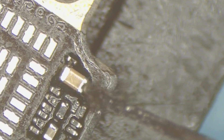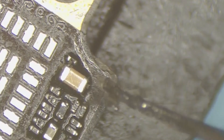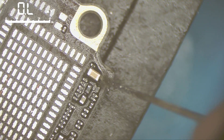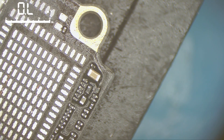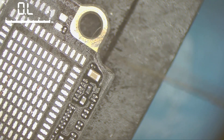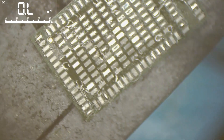The chip also has a high thermal mass. If you're getting solder balls from one side, that's actually positive because that side has a lower thermal mass than the ground side. But if you have solder balls from both sides, most of the time you are in trouble.